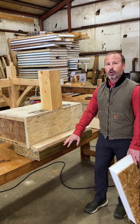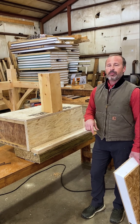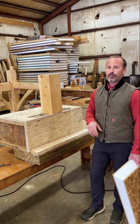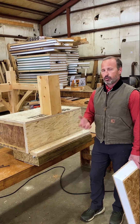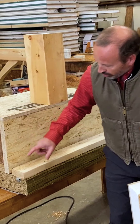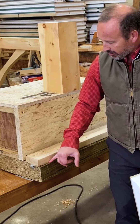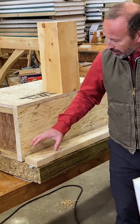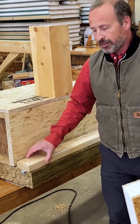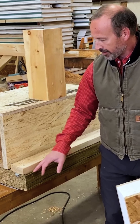The sill plate is attached to the top of the concrete wall with either a cast-in-place J-bolt or Simpson's Titan HD, which is a unique screw that allows you to drill a hole in the concrete and drive the screw in — they have gotten code approval for a one-for-one replacement with a half-inch J-bolt. We like to use the Titan HD because it ensures we get our hold downs exactly where they need to be. The 2x4 shoe is either nailed or screwed into the PSL, and we also use a proprietary sealant compatible with the SIP to bond the shoe down to the sill plate. That is a very important connection against uplift, and the sealant also prevents air from migrating in at the base of the house, which is a notoriously leaky section.